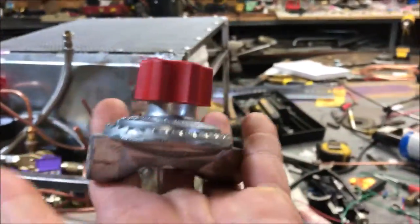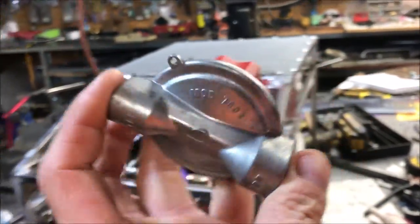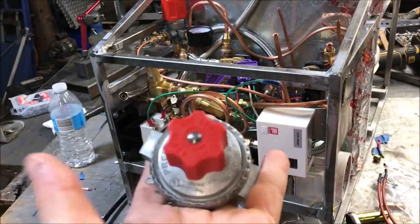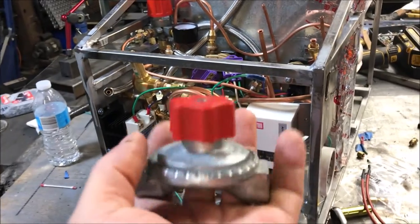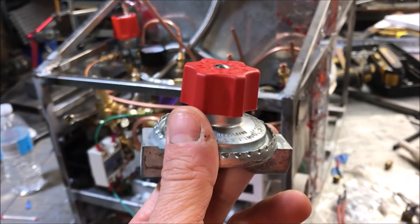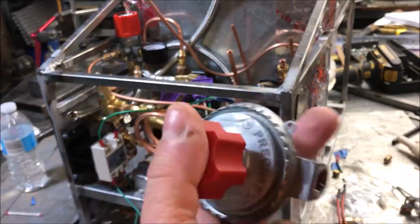One of the things I was going to install in this was this propane pressure regulator, and I could not find out what the pressure was on this. I had an individual on one of my videos tell me that these are 100 PSI pressure regulators. They also have a low-flow, low-pressure regulator that you can't use on a forge or a foundry. I'm going to be running a very substantial burner here — this is a 250,000 BTU burner in this thing.